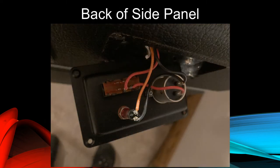This is a picture of the back of the side panel of a Yamaha CP80. On top is the power slide switch. Beneath it is the red power indicator light, and on the right is the two-pin cannon power connector. Notice how the black ground wire from the cannon connector is soldered to one terminal of the red indicator light.